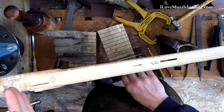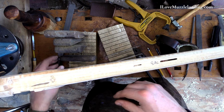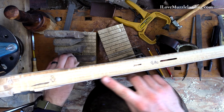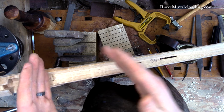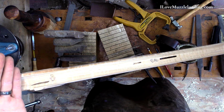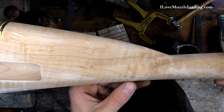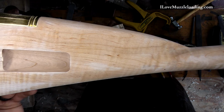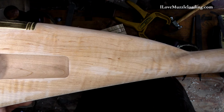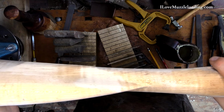And that's what we're focused on here. We're not going to be removing a lot of wood. We're not shaping with these scrapers. We're using them as kind of our last sanding or stock texturing step. Our stock is still drying, but you can see there a little bit of that texture coming up with that grain curling and whiskering up. That's what we're going to be removing with our scrapers.